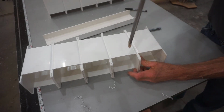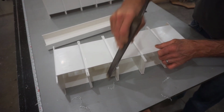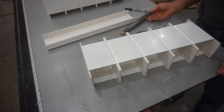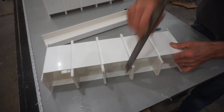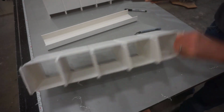After cleaning up the bottom lid, I spent a few minutes with a file, a grinder, the deburring tool, whatever it takes to clean up the bottom ends of all the compartment divider pieces for a nicer, cleaner final fit. There's fuzz from the grinder and little tabs here and there from the cutting process, and it makes a real nice fit and finish to just clean these up before this gets glued on a little later.